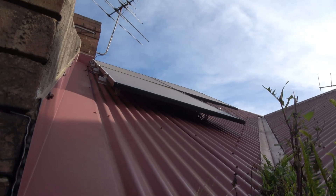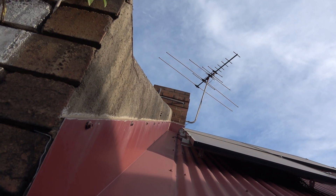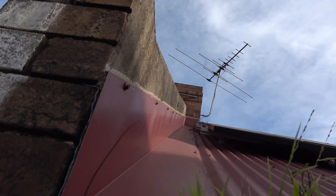The question is how this wall flashing is installed into the wall. If the wall is brick or rendered, we're really relying on sealant on the new wall apron flashing against the wall to perform perfectly over time. If the sealant breaks and water gets in, you get water trickling down the wall. The better option is to chase the wall flashing into the wall — cut a groove and chase the flashing in — so that if there's a failure in the render, water goes over the wall flashing rather than behind it, preventing seepage leaks along the wall.